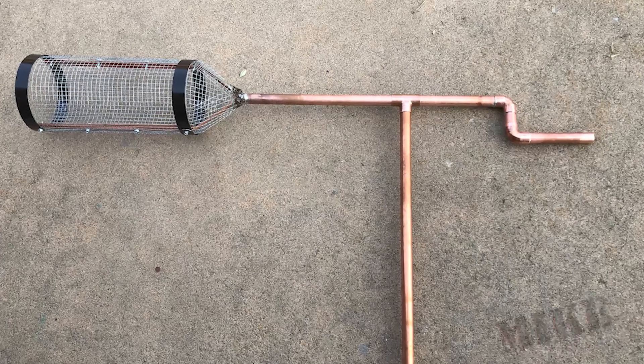And here we are at number five: the campfire coffee roaster. This is version one, made out of copper mostly. That copper shaft that holds everything together was actually split in two, and that's what supports the steel mesh on the left. Those rings that I rolled give the mesh a cylindrical form — otherwise it could just crumble. The mesh was screwed in four places on each side, and the split copper also serves as paddles to create the tumbling action.